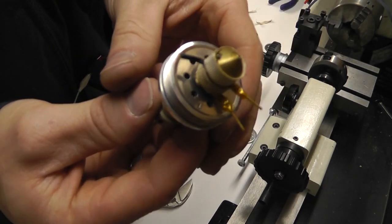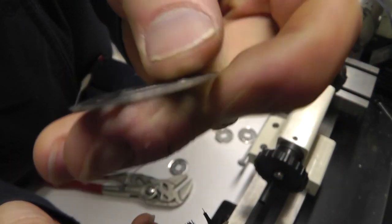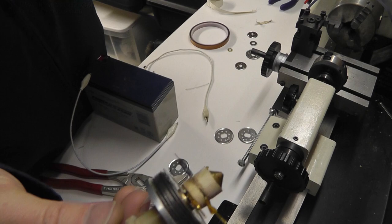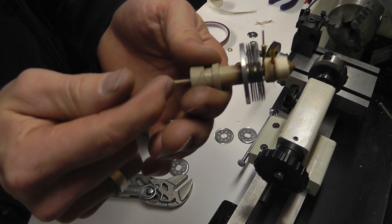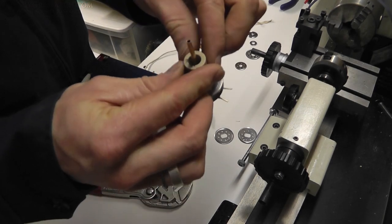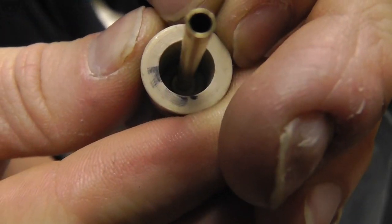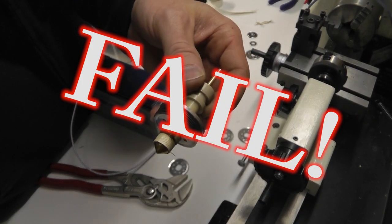I'm going to try this - these little stainless shims are off the tops of hard drives. I took number 14 brass washers and actually tapped them so I could thread all these in there and make them stay tight. If I can keep it cool enough where it doesn't get clogged here, I'll be happy. I'm going to have to run some air over this - one idea is to run air into this closed chamber and back out. Test this on the printer tomorrow and let it do the PID controlling, see what we come up with.